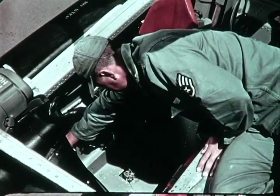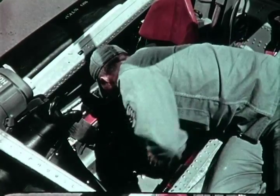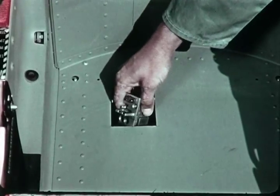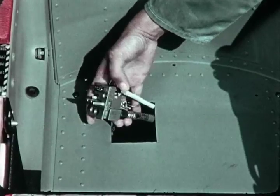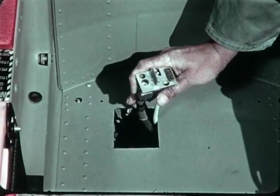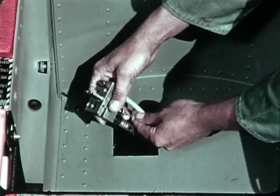In the cockpit, the technician makes sure the pilot's seat is lowered to its lowest position. He lifts the ship-to-kit disconnect fitting through the hole in the seat and checks the disconnect fitting in the ship the same as he did on the kit. The ship's portion of the fitting must be attached to the airplane structure by its lanyard.